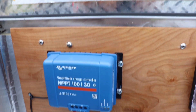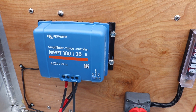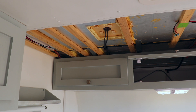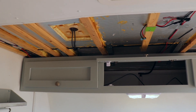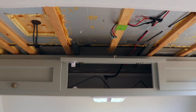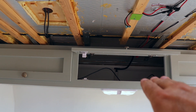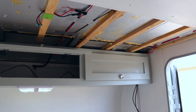I'm going to let it run for the rest of the day and throughout tomorrow and test the cooler, fan, and everything else. The solar's been on for a while now and all seems to be working as it should — none of the wires or connections are hot or even warm to the touch. The charge controller is just a tad warm, but that's to be expected with electricity going through it. Now I'll start wrapping all the solar wires in conduit, tidying everything up, and then reinstall the panel.